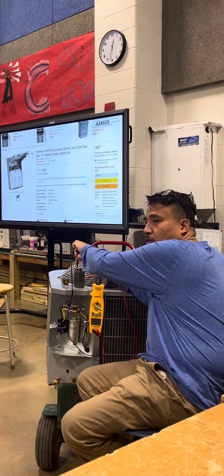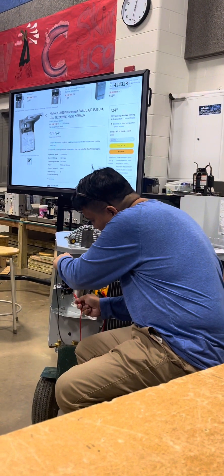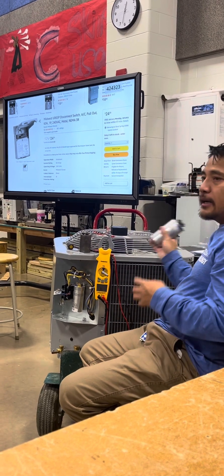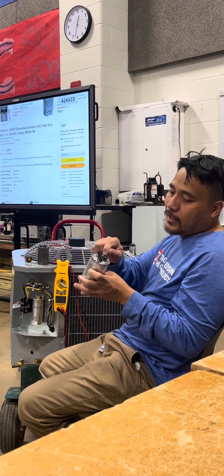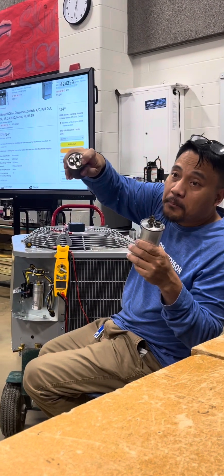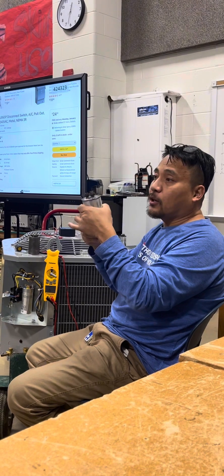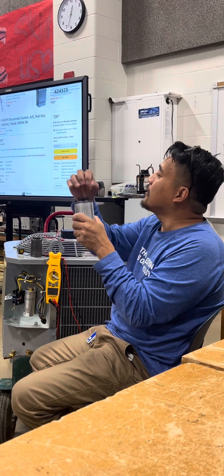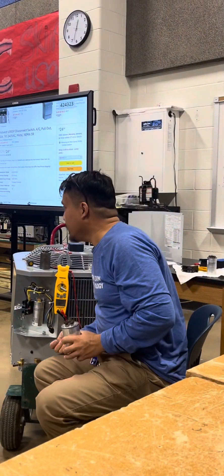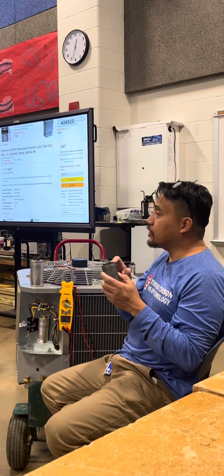From right here — no, no. So the same thing with this one: you check this, no sounds, no continuity. The same thing with this, and the same thing with this. So that's how you check the capacitor, and you will also see it visually. You see this? This is the dual capacitor. You see that the front is curved like oval — it needs to be flat like this. This part over here is the weak part of this capacitor. That's why when it overheats, it expands the top. If this one is up, meaning this is broken already. And this one over here, you see it's flat.